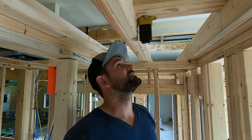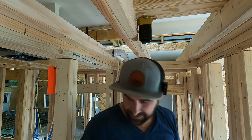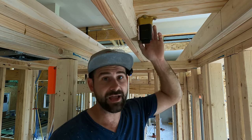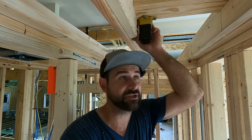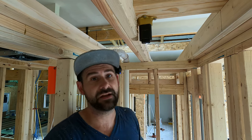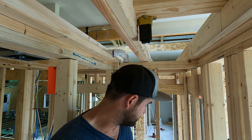After you get all your fixtures installed, I like to just take a moment and admire what I've done so far. Then you've got to figure out a way to get those mixed lines back to our shower valve. And by the way, we are going to use all six zones for that shower valve, because this is a two-stage rain head — it's got two different functions, and that'll require an additional zone.